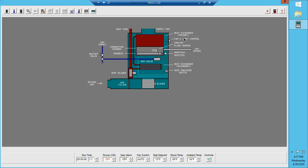We also have our fan limit control, which we have discussed in the past, and our heat exchanger. The heat exchanger is really where the heat of the flame is captured, and is where our heat comes from once our furnace blower turns on.